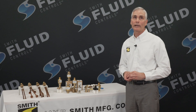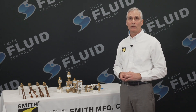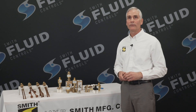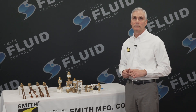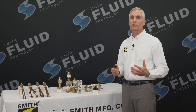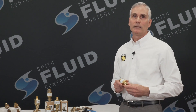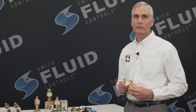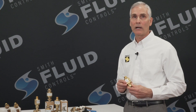We have versatility — it can be mounted anywhere there is a supply line pressure drop. We have flexibility — the foam ring stores the water pressure information. And we have self-adjustability: this Trap Primer is totally self-adjusting in that as the psi goes up, the foam compresses; as the pressure goes down, the foam expands — each action opening the Trap Primer Valve.